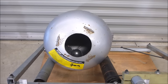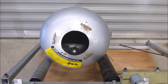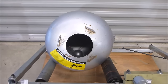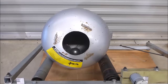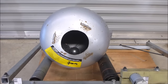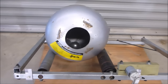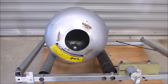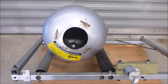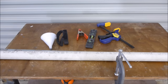One of the questions I haven't answered is how long it takes to turn those chips into fine talcum powder dust. The easy answer is probably about two days — about 48 hours — which might seem like a very long time, but you've got to keep in mind that I can move it out of the way somewhere in the workshop and it can just sit there and run 24/7. I don't actually have to physically do much other than take the powder out and put some new chips in, which is really the objective with this type of gold recovery.